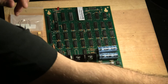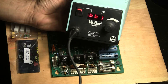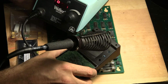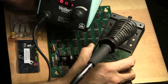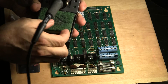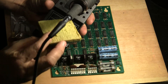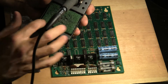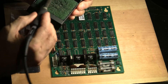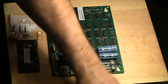So, tools. First off, everybody needs a good soldering iron. I'm a big fan of this Weller. Mine's got a digital display, so I can set the temperature pretty accurately, and I'm very pleased with it. For a little cleaning sponge, I've taken one of these Scotch-Brite pads and wet it. I find that works really nicely for cleaning the tip of the soldering iron — it's important to keep the tip nice and clean.